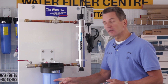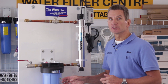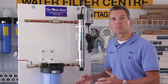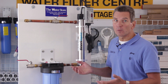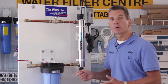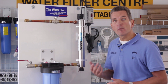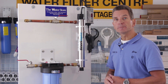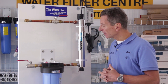The other thing you need to make sure of is the pre-filter — it's a great time to change that filter too, so have a replacement one. You need to have a bit of cleaning supplies because once you shut off the water and you're servicing this, you won't have any water. So it's a great idea to have a bucket of water ahead of time, a brush to clean out the inside of the filter housing, some CLR or LimeAway to clean the quartz sleeve, and some rags.